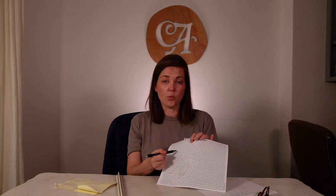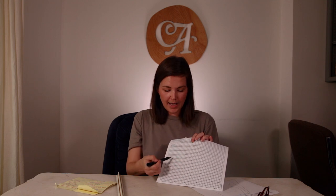Now that you have your measurements, apply them to your grid paper. You get to choose what the scale is for this plan — whether each square represents one foot or four feet, that's completely up to you. Just make sure that what you've measured can fit onto your plan. For example, if your total measurements add up to a hundred feet from side to side, you need to make sure that will fit. So choose a scale that fits appropriately — if a hundred feet has to fit across, each square might need to be about eight, ten, or even twenty feet, depending.